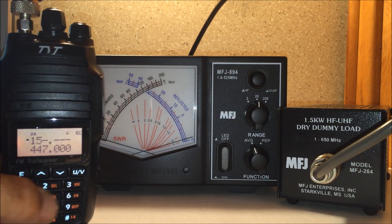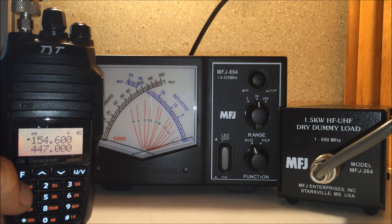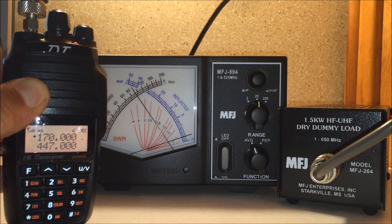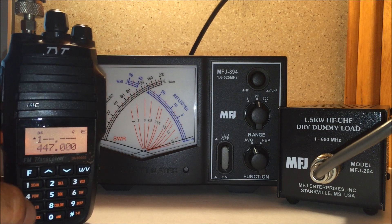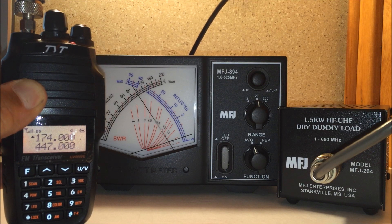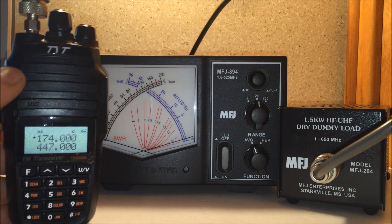Let's go up to business band: 8 watts. Let's go up to 170 MHz — that shows just over 9 watts. At 174 MHz, the maximum VHF frequency we can transmit at, that shows just about 10 watts — about 9.7 to 9.8 watts. So it may achieve 9.8 watts at 174 megahertz.